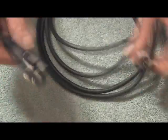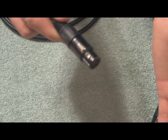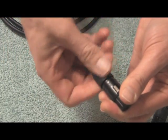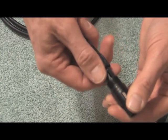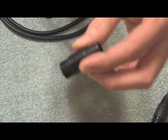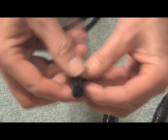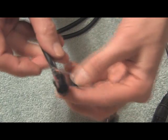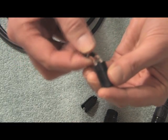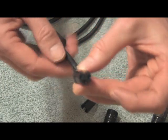The newest type of XLR is made in Europe by the Neutrik Corporation, and these are great. At first glance, people are really confused about how to get these apart because there are no screws, which is kind of a nice thing. All you do is take off the hood — it just unscrews. Pull the hood back and the whole assembly comes loose from the housing. Here's our connector block. What's cool about the Neutrik is that they use what's called a chuck, which crimps the wire down and forms the strain relief once the hood is screwed back on. Again, we have our three connectors: bare wire to pin 1, pin 2, and pin 3, and those are stamped on the front.